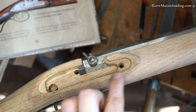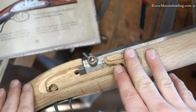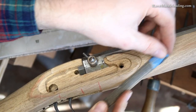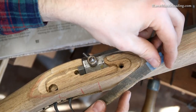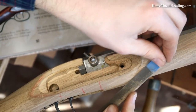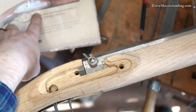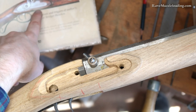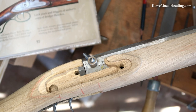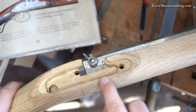I want the guard in when I'm working that area and this area back here, but I want to be able to get down to our trigger plate level in here. So I'm just kind of making a note there to not go into or past that line as much as I can keep from it. I'm gently coming in here, just trying to blend this out a little bit. I'm kind of using this still as a way to clean up that mortise. Now I have some of the mistakes here on the top face of this lock mortise. We're going to bring this all down and bring it in a little bit to match up with our lock plate, so I'm hoping we can even that out and crispen it up a little bit. I'm just taking my half round, coming in on the underside, doing a little bit more blending.